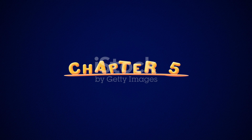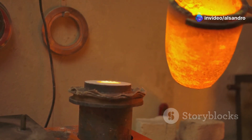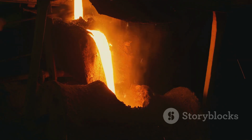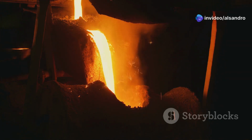Chapter 5. Breathing easy and breaking free. The functional perks of Greensand. Now let's get a little more into the science of what makes a good mold, because Greensand has a couple of inherent physical properties that are incredibly beneficial for achieving high-quality castings: good gas permeability and excellent collapsibility.